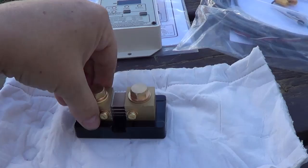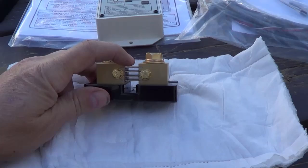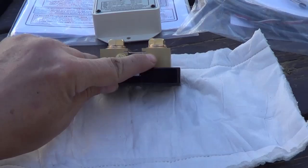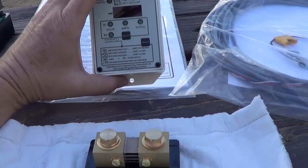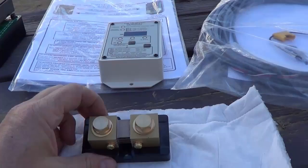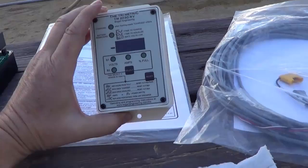What the shunt is going to do is — I have a couple of wires into this — and this shunt will give the reading to the monitor so it knows how much current is going through the negative wire of my system. It's a very low resistance, low impedance resistor — extremely low so you don't lose very much wattage across it. But by putting some sense wires on these two terminals, the monitor picks up the change in voltage as the current goes through there, does a mathematical calculation, and can read exactly how much current is flowing. At the same time it's picking up the voltage of the batteries, so in combination of the two it can tell what percentage of charge your batteries are at.